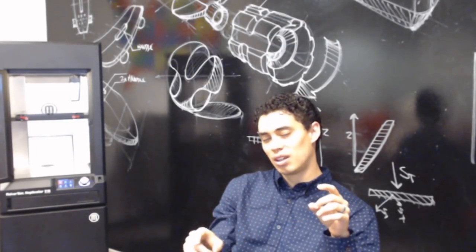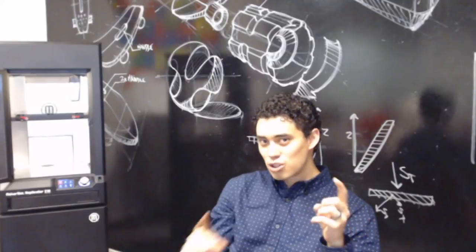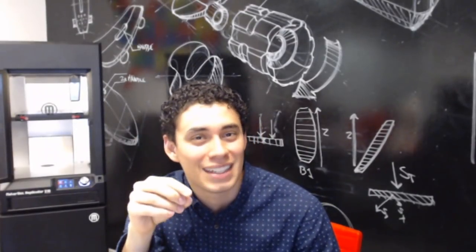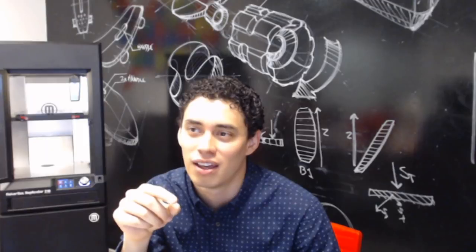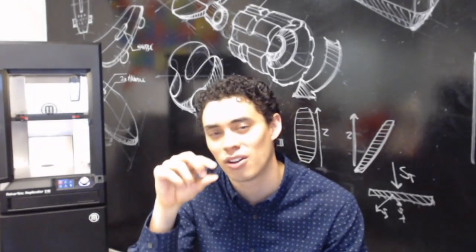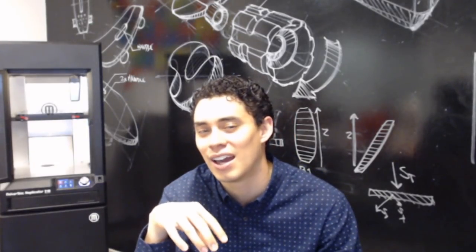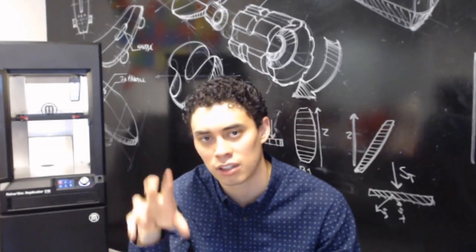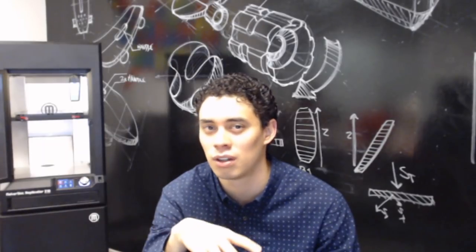However, I shouldn't say this, but you can actually print the tough material with the regular extruder, but it is going to compromise the life expectancy of the extruder, and I've seen that happen. It's possible, but after a few cycles, the spring on the extruder can wear out, and I wouldn't recommend it personally. You can definitely print regular material in the tough extruder, but not tough material in the regular extruder. It's possible for a few prints, but you will be compromising your system.